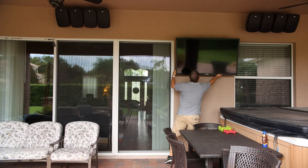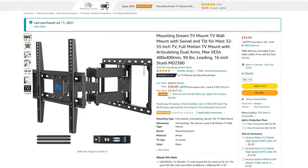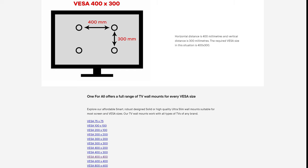Although the Furion does come with a fixed TV mount, I wanted the ability to rotate the TV and pull it away from the wall, so I used Be The Installer's recommendation of the Dream TV full motion mount that easily extends, swivels, and allows me to angle the TV downward. You can check out the links in the description for Be's channel and this TV mount. Whatever size TV you choose, be sure to get a TV mount that matches the VESA pattern — the 55-inch TV is 400mm by 400mm VESA compatible.